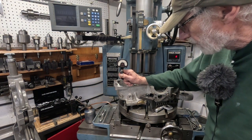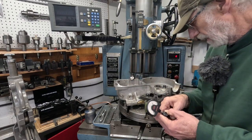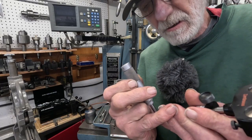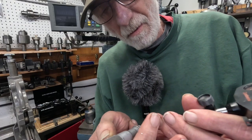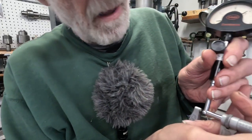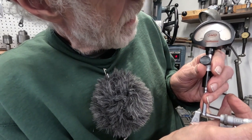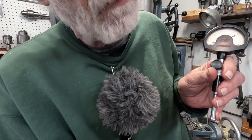I'm going to gauge these holes here with the dial bore gauge with the ball type tips. They work quite well with the micrometer. Bring it to zero, round direction here. I can bring it right to zero there and we're 0.3175.